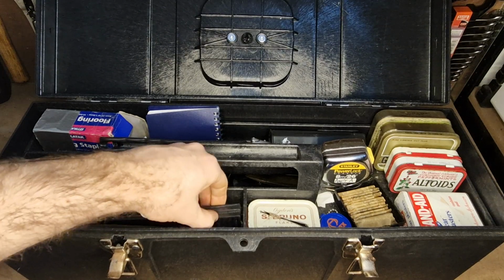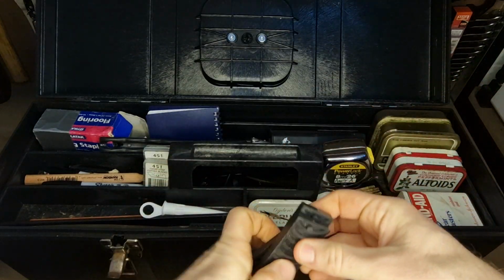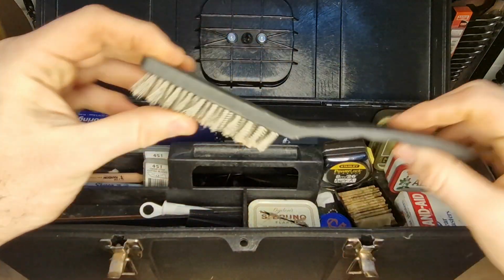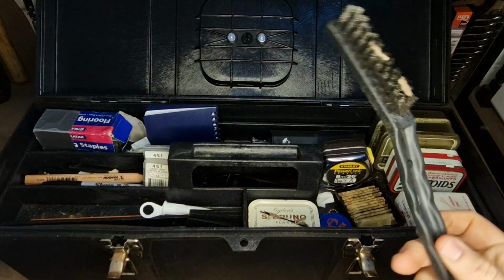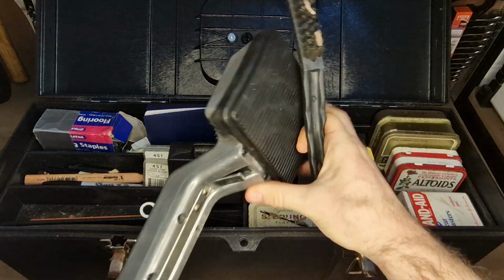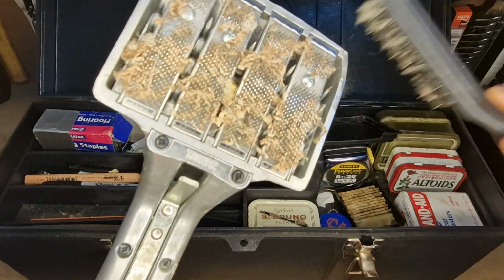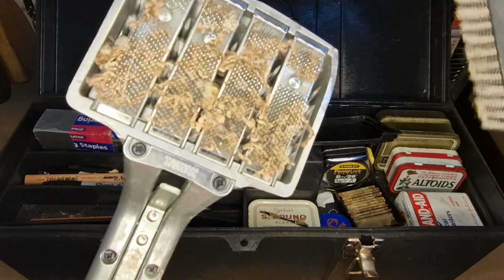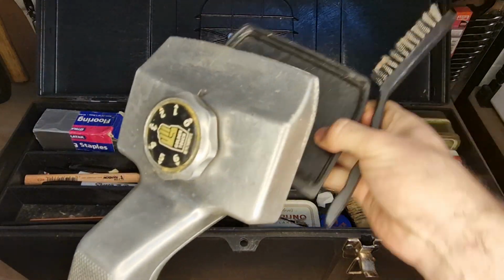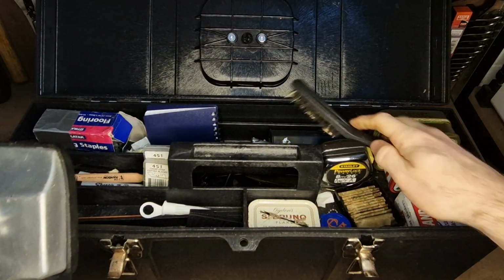I've got a few little spacers for if you're doing laminate flooring, and I've got some more in the box as well. And I keep this here as well, little wire brush. It's just good for your knee kicker. If you just want to clean it out, you can just get all the fluff and bits and pieces out of it, clean it up, and it bites a lot better on the carpet once you've done it every now and again. So just keep a nice little mini wire brush.